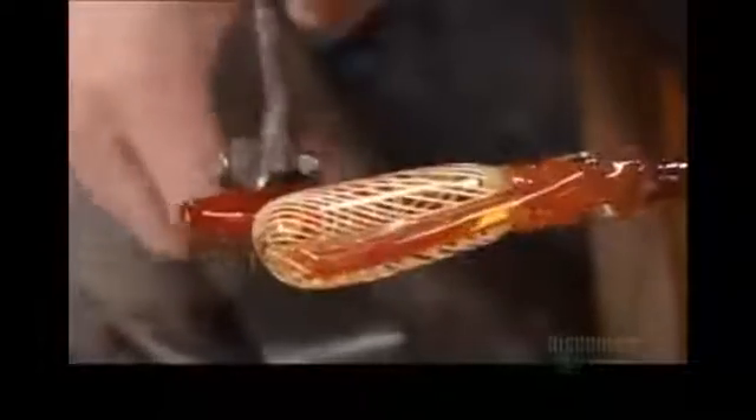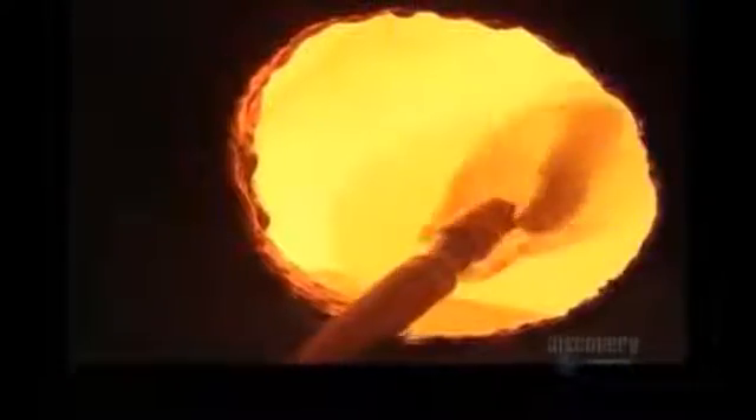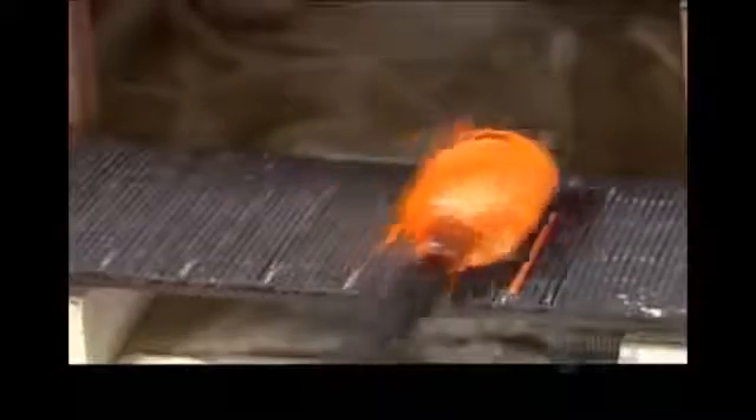After rolling them in the furnace to melt them, he flattens the ribbons with pliers and snips off the excess at the ends. He wraps the core and the ribbons in a layer of clear glass, then handshapes it. Now he rolls the core on more glass strings, then it's back in the furnace to meld them. He adds one more clear glass layer and the inside is finished.